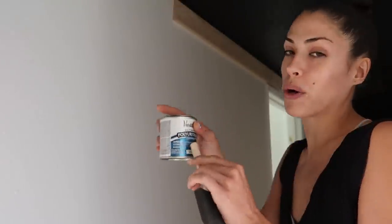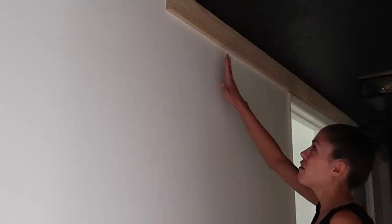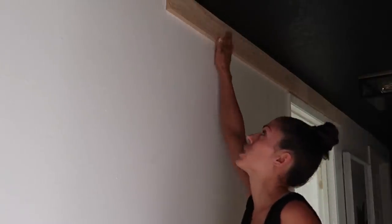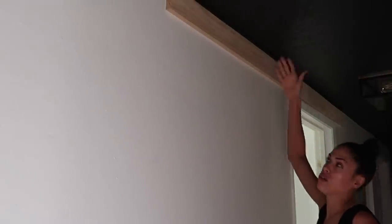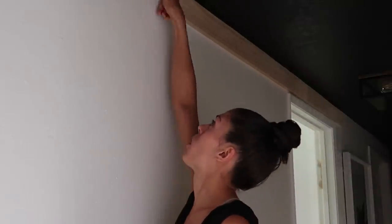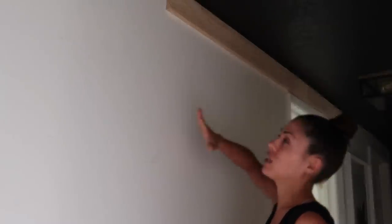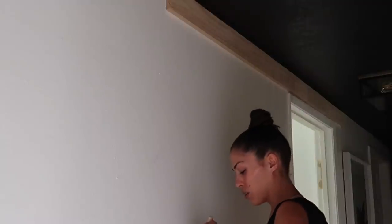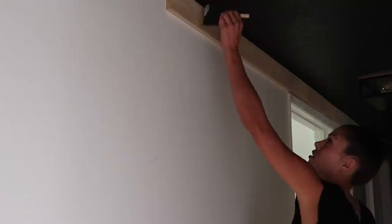Holly loves the natural wood, so we're leaving it - just adding some polyurethane. Going with a water-based interior matte, applied with a foam brush. There's some pet hair and fuzz to clean off first. Add sealant only after the wood and wood putty are completely dry - that's why I like the pink-to-natural putty, because it tells you exactly when it's ready. Adding caulk to the edging so it blends more nicely. I'm going to let this dry for a couple hours and add a second coat. You do want to protect your wood on all sides. I realize my brain has been skipping through some steps lately that it necessarily shouldn't.